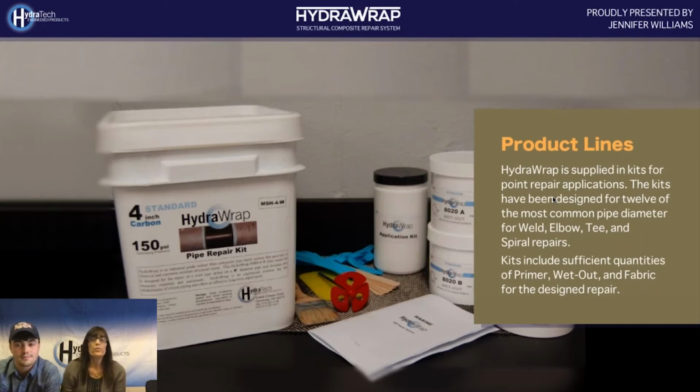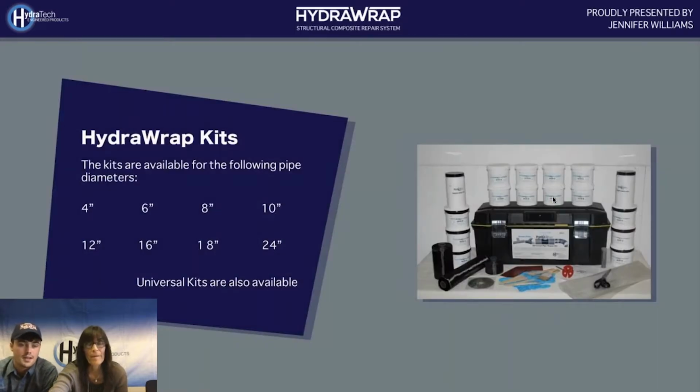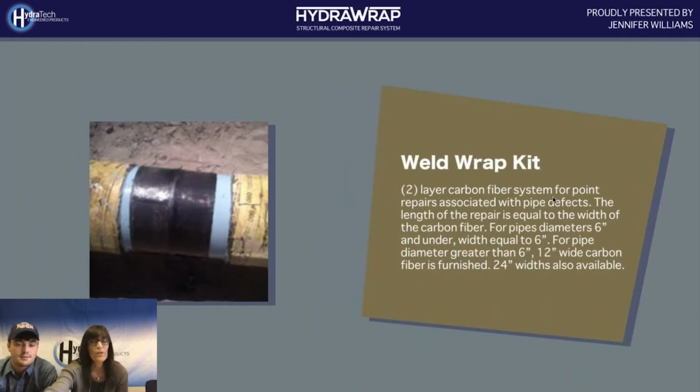The product lines that we supply in kits for point repair applications are for weld, elbow, T, and spiral repairs. All the kits include sufficient quantities of the primer, the wet out, and the carbon fiber that is designated for that repair. They come in these diameters. Those are the standard sizes. The Weld Wrap Kit is a 2-layer carbon fiber system. This is the only one that can get away with just the 2 layers. All the rest of the kits require a minimum of 4 layers.